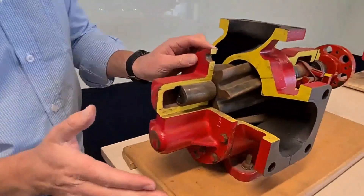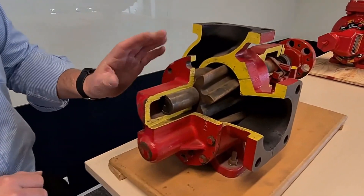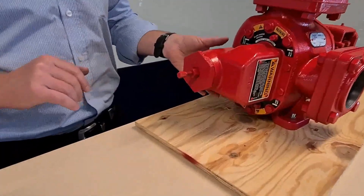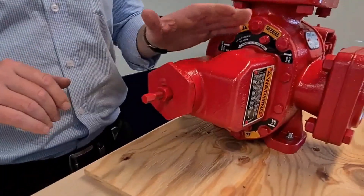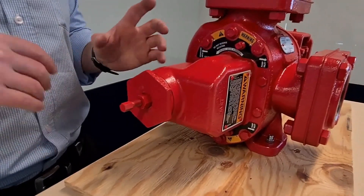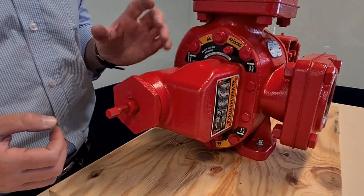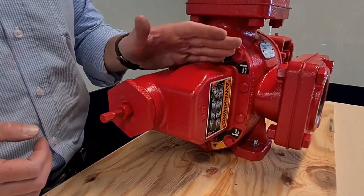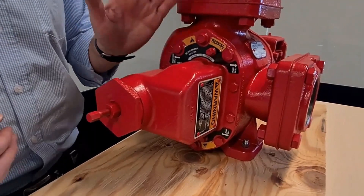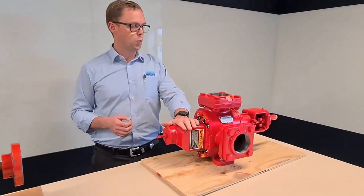Around the front of the pump, this is a plain pump end without a relief valve. If you scan across to this other pump here, this faceplate looks a bit different — this is because it has a relief valve built into it. This basically prevents overpressure situations. So if an operator inadvertently closes a valve in the discharge, the plate inside the relief valve will just lift and the liquid will recirculate internally, preventing pipework and what have you from blowing up, which is something you really don't want.